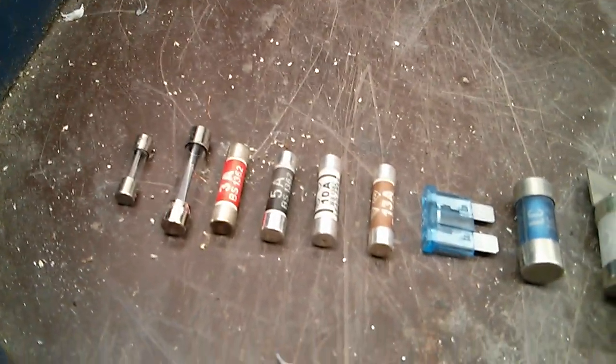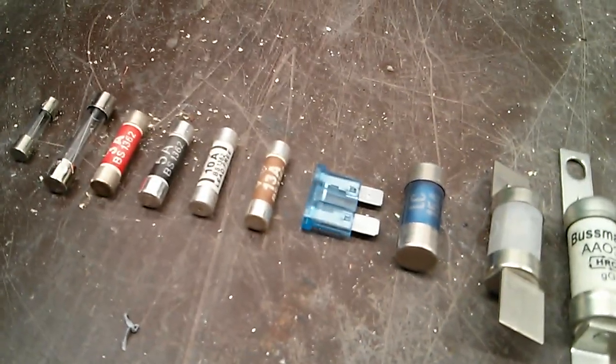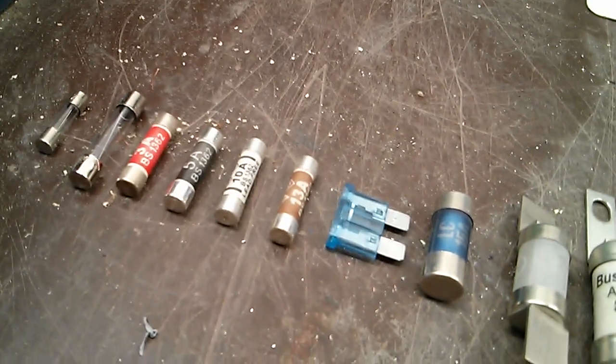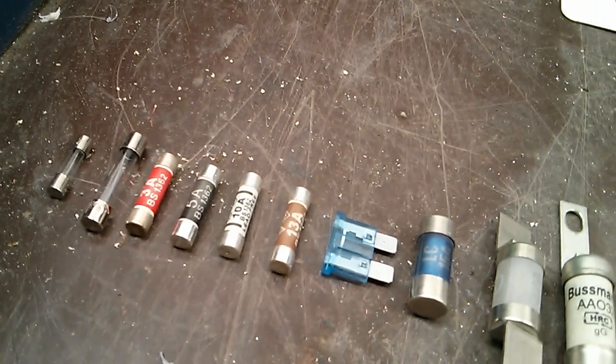A lot of people tend to take a 3 amp fuse, it pops — and to stop the problem they just stick a 13 amp one in there. And it fits just the same. You usually end up getting wires melting, because if you've got a 13 amp fuse and the wires aren't rated for 13 amp, obviously your wires are going to burn up. People — especially some mechanics and plumbers — think they can just swap in a higher rated fuse where a 3 amp was specified. Very naughty. You also get people putting sawn-off nails, bits and pieces, tin foil, chewing gum wrappers, screws, bits of wire — all sorts of things found in there. These are the proper ones to stick in.